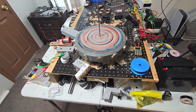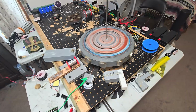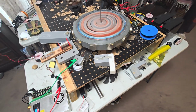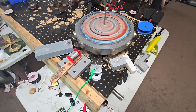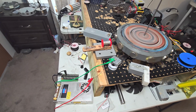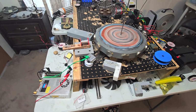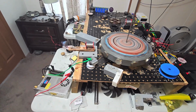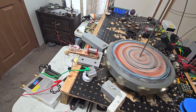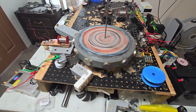So I don't know if maybe we could get it going faster if we used a different method of switching. But this is one coil at 12 volts. And there it is, yoked in aluminum. 11.4 ohms of 32 gauge. I have no idea how many turns it is. Like I said, it's probably 200, 150. It's about 5 layers, and it just covers it basically. I had to wrap it by hand, so I didn't get a counter on it. Just let it speed up a little bit.